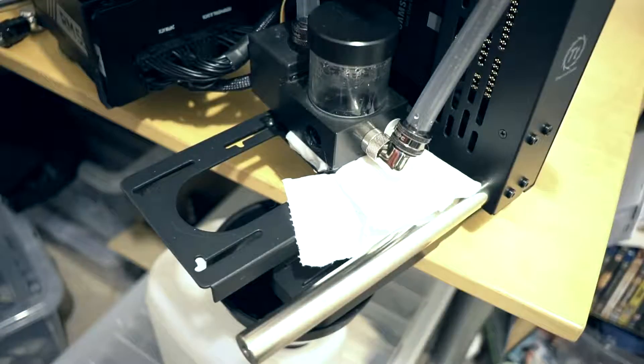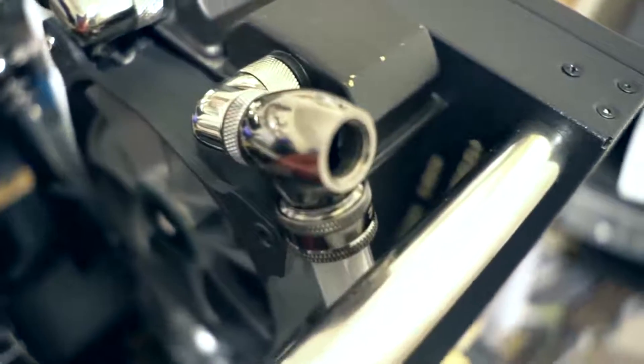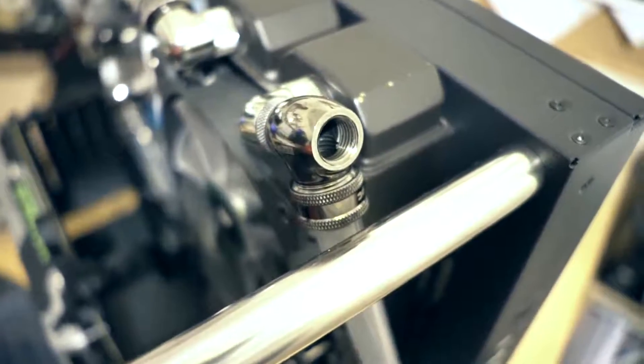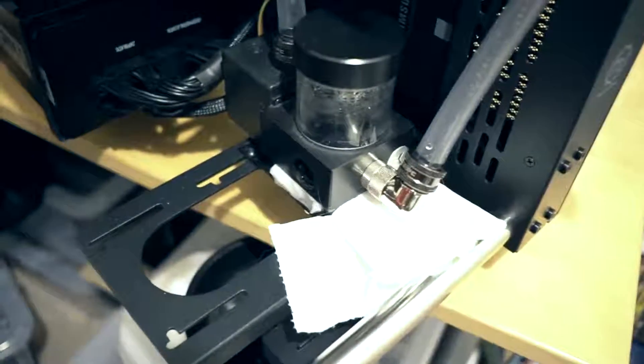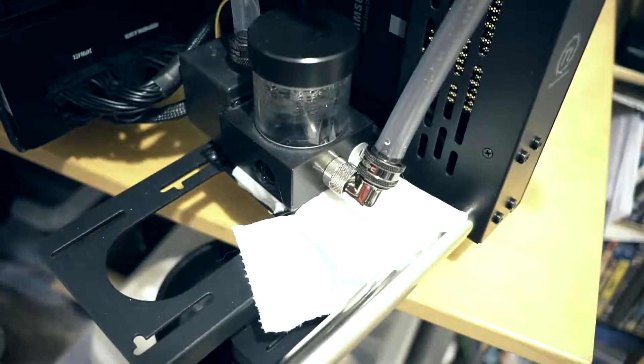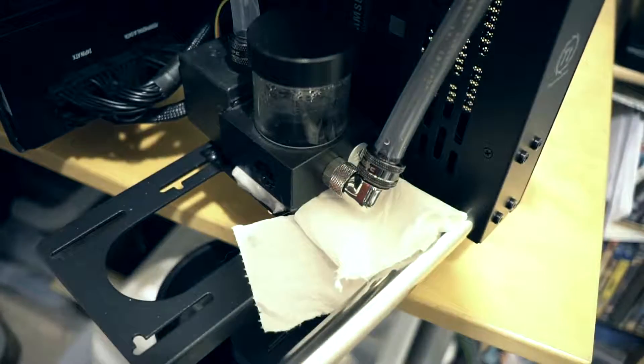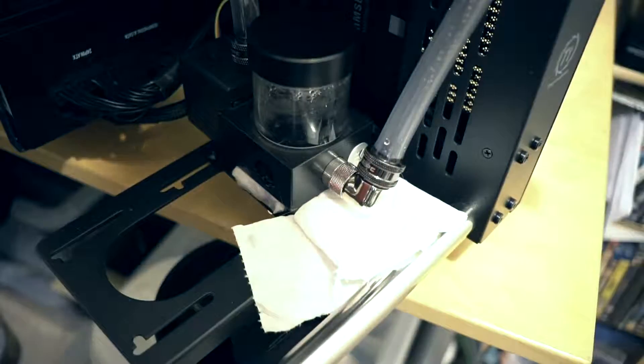So I've just blown into an outlet — an inlet, let me see if I can get a quick shot of that. So that's it there. That's just so that no bubbles can get trapped at the top, so essentially release the vacuum. So then the trapped water can just come out. And then I'm going to put in a thermal sensor at the top so I can measure the temperature as the radiator gets hot. It's not necessary but I like to know.